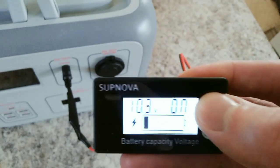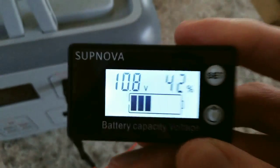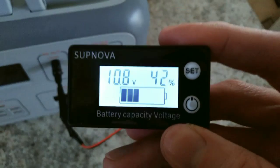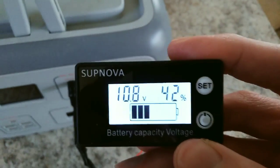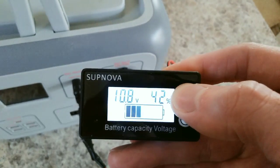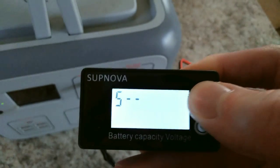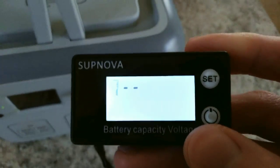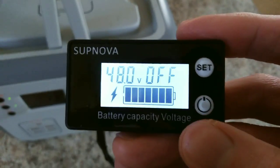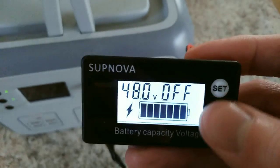One important thing: in order for that alarm to work, the screen backlight has to be on. That's why I don't recommend using the auto screen timeout, because if the light's not on, the alarm won't work. Going back into the settings menu — there are actually seven menus in here. I don't know what five and six do; if someone knows, leave a comment down below. And then number seven is the high voltage alarm — same idea. If you don't want to charge your battery all the way to 100% to preserve it, you can set that. I don't even use that on this one.